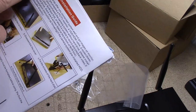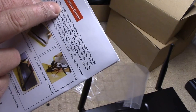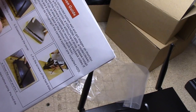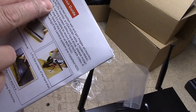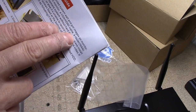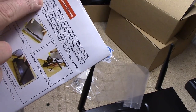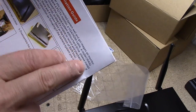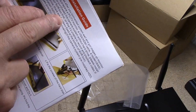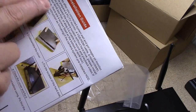It says now in the poor English, please don't install cameras after you connected system well and got images on monitor. Before connection, please prepare PC TV or a VGA HDMI cable, a router, and hard disk. If you purchase the camera system without a hard disk, please install the hard disk into your NVR box first, or else it's unable to record and playback video, of course.